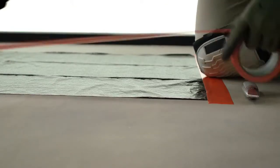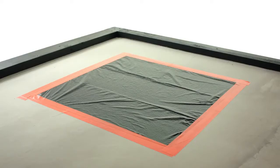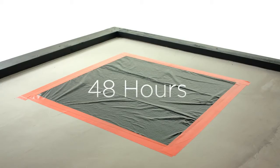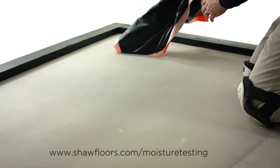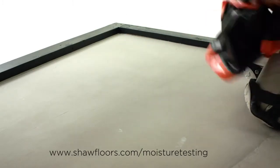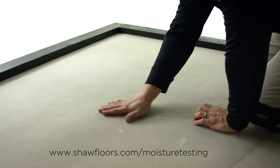Another important part of your prep work is moisture testing. Moisture under your floor can be its worst enemy. You can buy an expensive tool to test this, or you can easily test your concrete subfloor for moisture by taping a trash bag to the floor along all four sides, creating a seal. After 48 hours you can check to see if any moisture was captured by the trash bag. If you do think moisture might be a problem, it will be necessary to use a more advanced test — follow the link below to learn more.